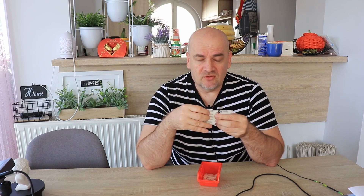Quick conclusions: the two most important things I didn't like about this filament — first, it has to be dried out of the box; second, it has weaker layer adhesion, even raising the temperature above the recommended maximum. This means we have to keep this in mind when designing products — they need to be stronger along the Z-axis. The two things I liked most: first, when the load is perpendicular to the glass fibers — as in the bending and creep tests — it performs better than regular PLA. Second, the temperature resistance at approximately 110–120 degrees Celsius is far above regular PLA, and this is without annealing. If you have additional experience with this filament, share it in the comments. Thank you for watching and happy printing.